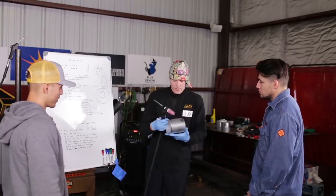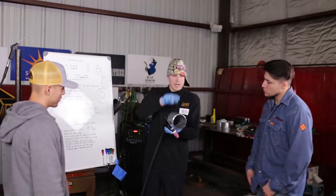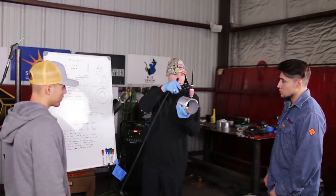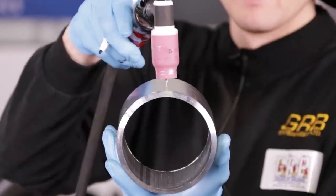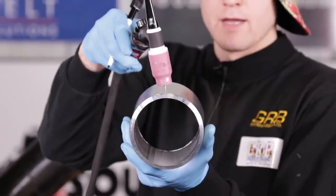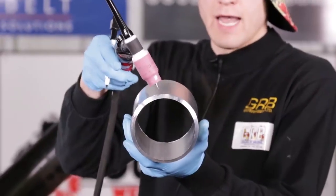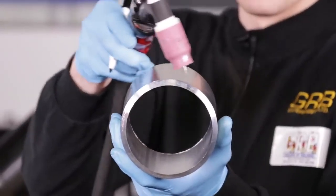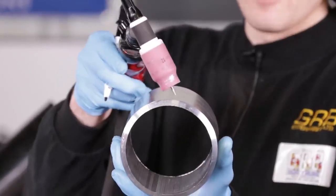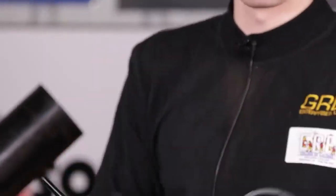Now, when it comes to perpendicular, essentially what I'm talking about is if you have a 90-degree carpenter square, perpendicular is straight up and down. So if this is my pipe, it's straight up and down. Any deposit, the weld ripple, the weld puddle here is going to be protected away from the atmosphere. And when I'm talking about adding an angle, even a 5-degree or 10-degree angle, you're making the weld puddle go oblong, and the metal ahead of the arc is going to start oxidizing. So when you're welding up to that, you're going to be welding over oxides.